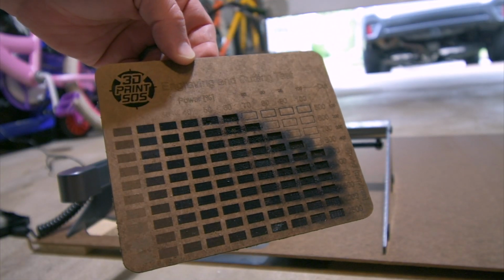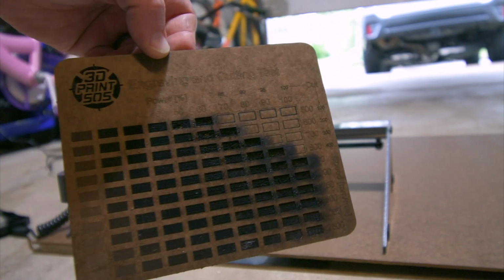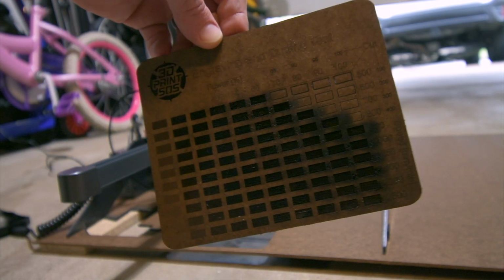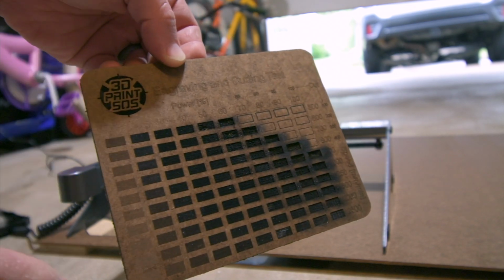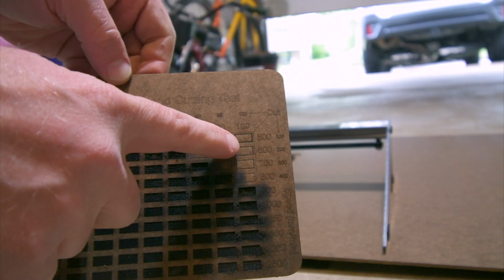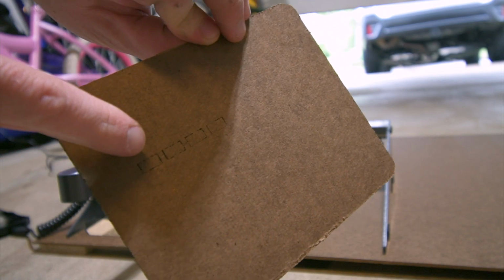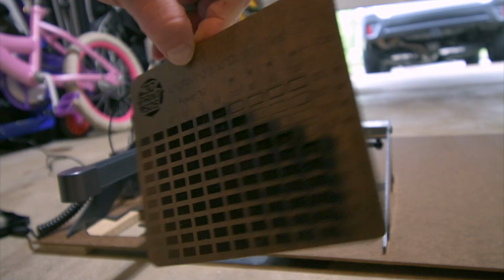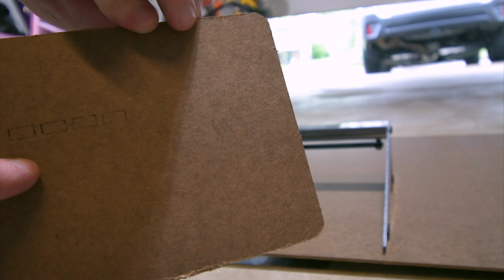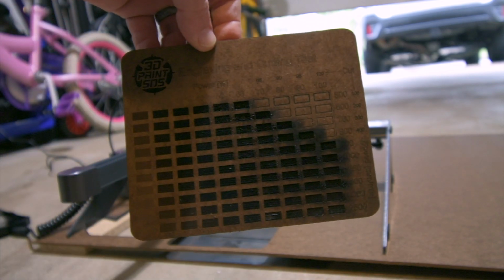Alright, I got another test done, and this one is updated. I added some more information about the cut settings so that you know. I added a fan sitting off to the right there just to get some more smoke out of the garage. But basically this test cut significantly better. It did better in some spots. As you can see, on the bottom there was still some fraying. But at 100 millimeters per minute at 100% power, we are almost cutting all the way through, just a hair. I bet if I push on this it will fall out. So what that tells me is I can reduce the power to somewhere around here or even here and do 2 passes on a cut, and for this particular material it will fall right out.